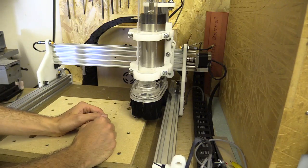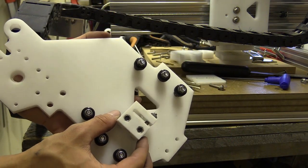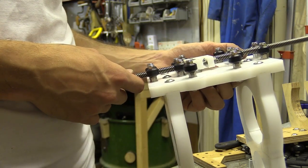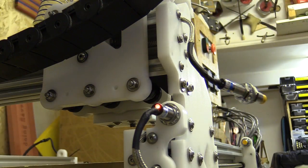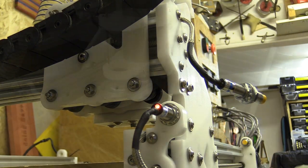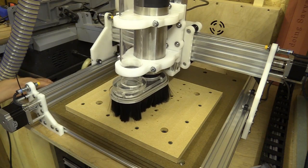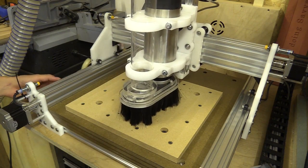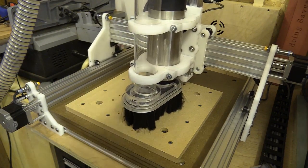So that's the CNC machine assembled. It's a shame I accidentally mirrored the anti-backlash nut blocks, but the threads are under tension and if I have to I could always make some new ones with the correct orientation or just buy some from the parts store. This machine feels very sturdy and I'm happy with the outcome. Thanks again for watching, and in particular to all the patrons who have supported this channel and build. In the next video I will level the wasteboard, square the axes and tram the spindle.